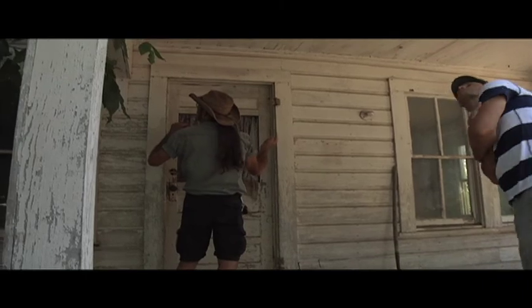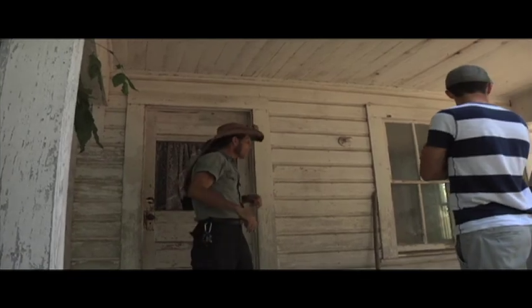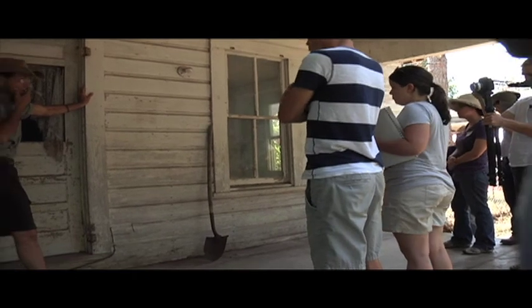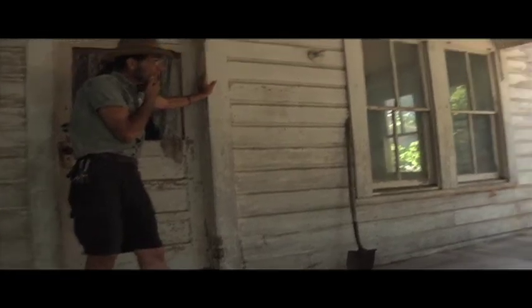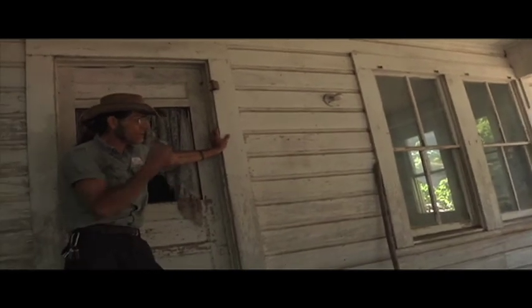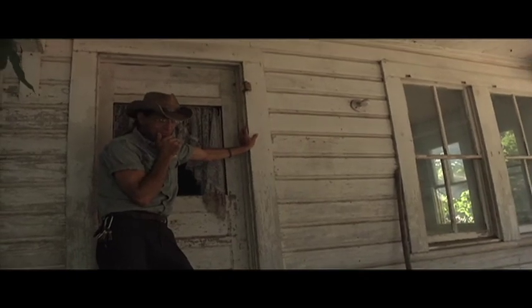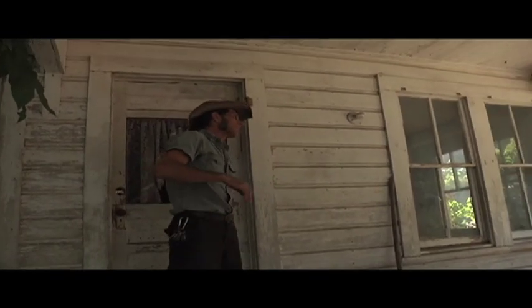There's probably not a lot of wood rot either. I know from having been inside that there was a leak. As for the concrete porch — it's going to be hollow inside with dirt, brick, and fill material, then the slab poured on top. I'd say this slab is probably not more than 25 years old — that's relatively fresh for concrete. It also stayed surprisingly level, so whoever put this in knew relatively what they were doing. Does anyone have a marble? The best way to test levelness is a simple marble — put it on the surface and see which way it rolls.